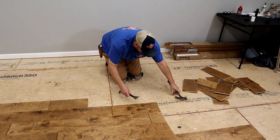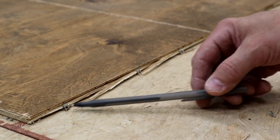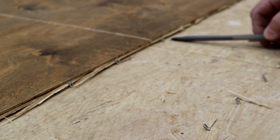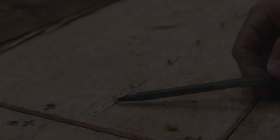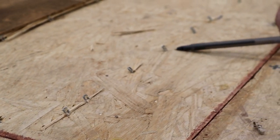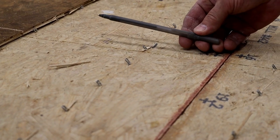Take a look at the staples here. Notice how closely they're spaced — about two to three and a half inches apart. This is typically what you're going to be looking at as you tear up your floor. The staples should be about that far apart, which is why it's a lot easier to cut the floor into pieces first.